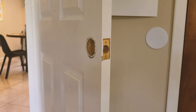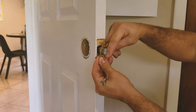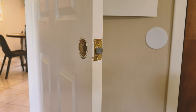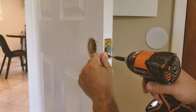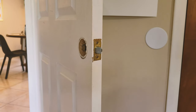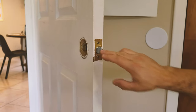Now we're going to slide the new one in there like this. Remember that the slide going up needs to be facing the plate because that's where the plate comes in. Then using the new screws that came with it, go ahead and put them back in the same hole. Don't change anything other than the parts. As far as the holes go, same spot — because it's already measured and aligned to work with the plate on the door. So this part is now done.